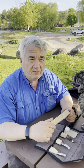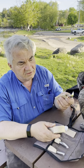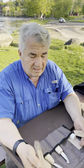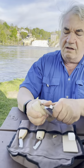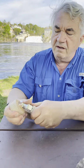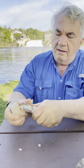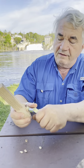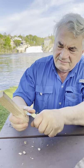I want to do a series of short videos on spoon carving. I have a longer rambling one in many parts, but for this first one I thought I would talk about just scooping the bowl. I pulled my kit out of my backpack and I'm sitting here alongside the river. We start to carve across the grain — this is butternut, by the way — then flip it around and come back the other way and meet up in the middle.